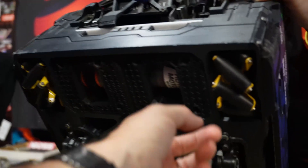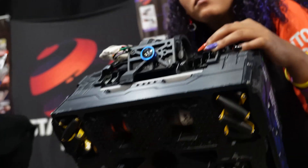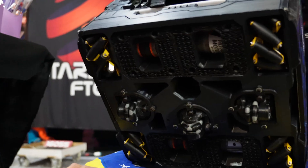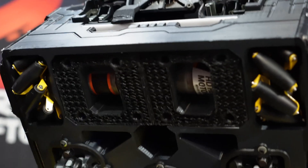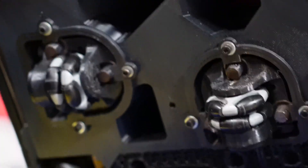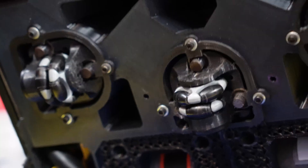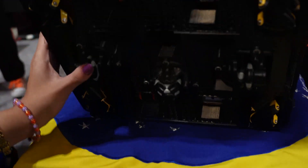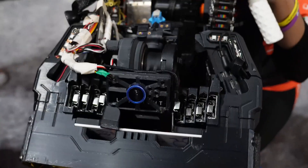For implementing the custom odometry pods on the robot, we have a little chamber inside the drive frame where we screw them in, so we don't have to worry about anything falling off during the match. Another feature of these custom pods is springs that make sure the wheel is always reaching the ground — it's kind of like a suspension system.